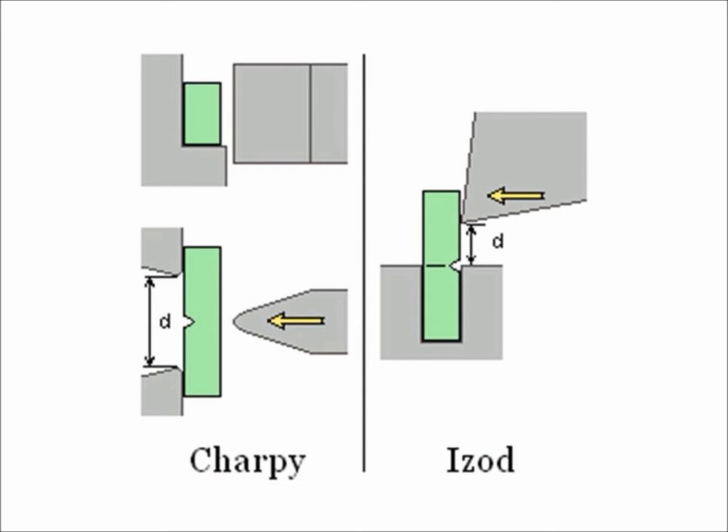Here are the two setup possibilities of the EEICI unit. In the Charpy method, the specimen is simply resting on its two ends. There is a gap between the stands with a distance of 60 millimeters. The hammer that impacts the specimen is in the shape of a wedge whose sides form a 30-degree angle.